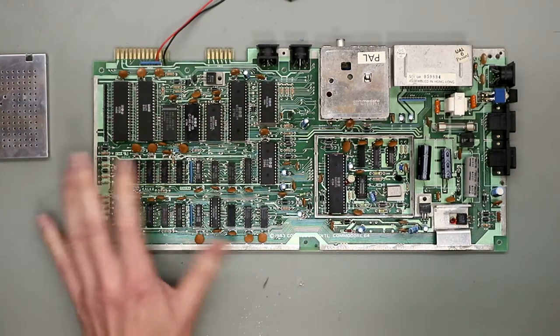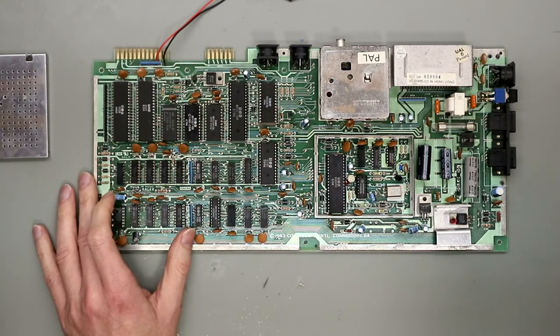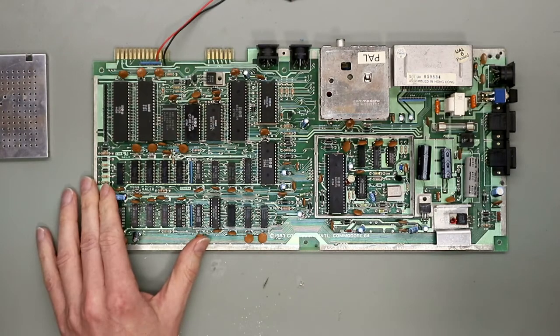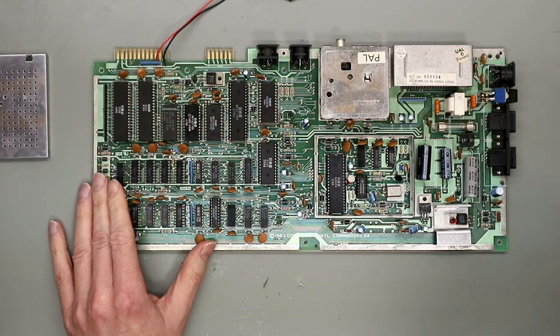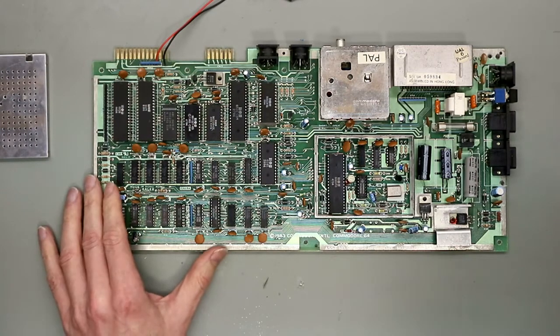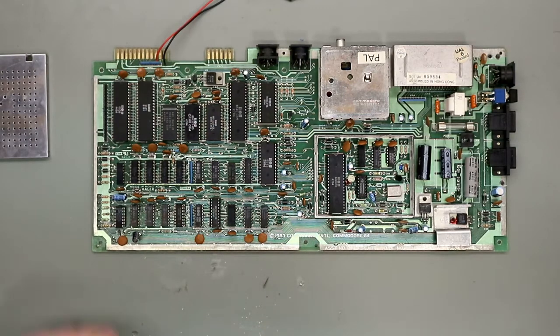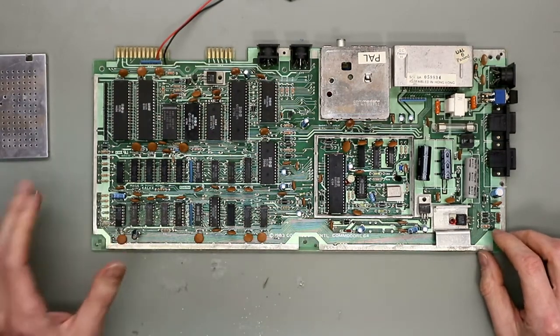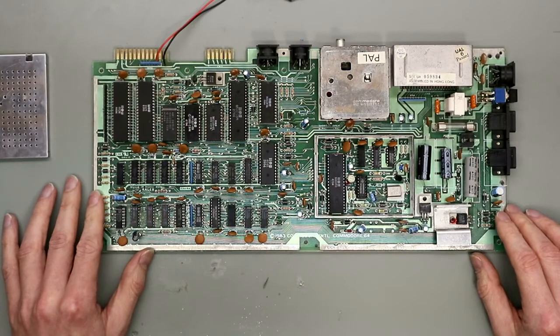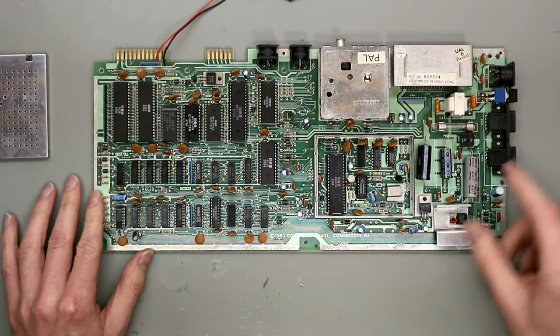So, one of the refurbishers from retro computers don't recap the boards, some other recap when needed, and some recap every board. I prefer recapping every board, so I think the machine works more decent with new caps. The caps are old, and so we have no problems with bad caps. So we change this one by one, I said, so let's go.